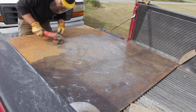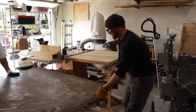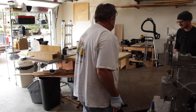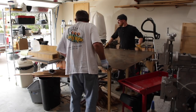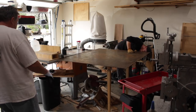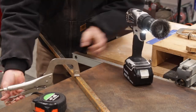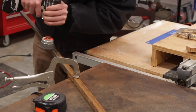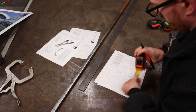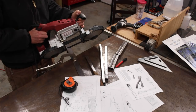I knocked a fair amount of rust off in the bed of my truck before I brought it into the shop, and I don't have a proper welding table currently. So this sheet will serve as a stopgap welding surface until I can get around to building or acquiring a welding table. For the time being, it's just sitting on the outfeed table of my table saw. I cleaned up the three-quarter-inch steel tube and inch-and-a-half flat bar with a wire brush in my drill, and cut it to sections roughly the right length using a portable bandsaw.